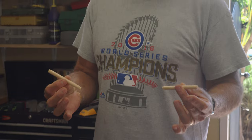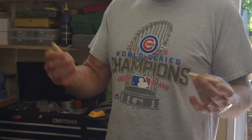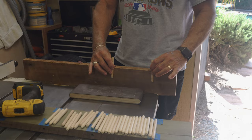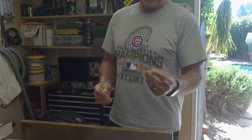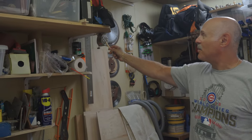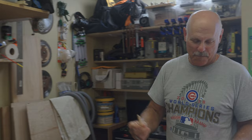So making a food board, obviously for photography, it has to be flat. So we wanted to go with longer dowels than you can buy pre-cut fluted at like Home Depot. So we cut them ourselves to the length we wanted, 4 inches in this case. It's gonna go pretty deep into each of these holes. So we wanted to taper the ends ourselves to start them into the hole. My trusty pencil sharpener is adjustable to do that.